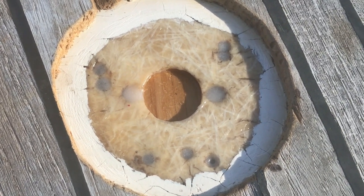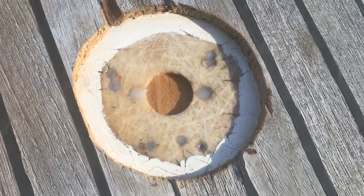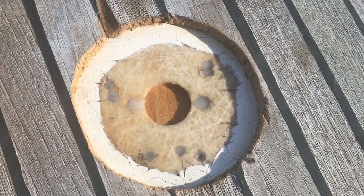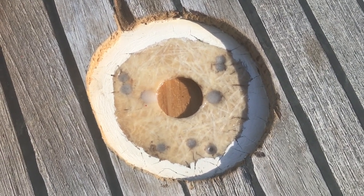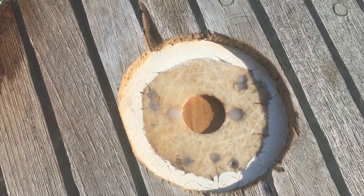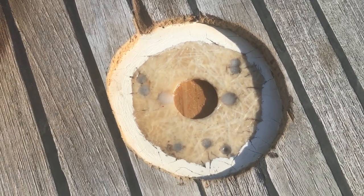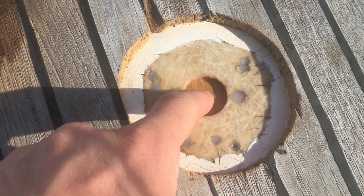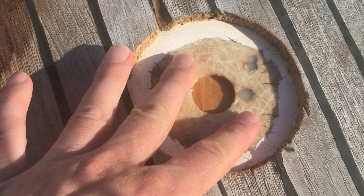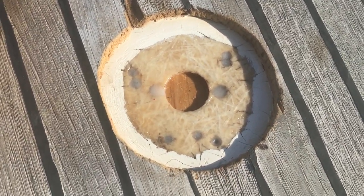I was going to carry on with the glasswork, but unfortunately the epoxy is past the ideal point — I did the fingernail test, pushed my fingernail in and was barely able to divot it. So being a novice, I'm going to wait, sand it all out again, and fill any voids. I'll probably fill it with more thickened epoxy to get a flatter surface for that first piece of fiberglass. Alex over at Buckmarine had a good point: I could have manufactured the core piece first and then dished this all out, so it would be continuous from center to outside. That's a pro tip to keep in mind for the future.